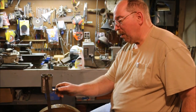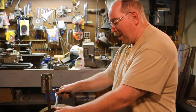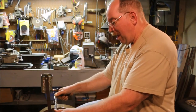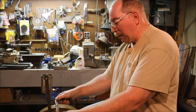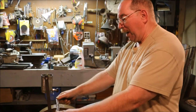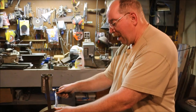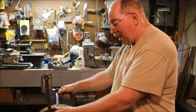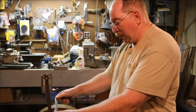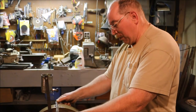I can see one issue. The vibration is causing the valve to open. I think a little tiny O-ring in there would probably put some friction on that valve and make it so I don't go through the water as fast. Because right now I've got a flood pouring out. But at least the valve lets me control it. If I drilled a hole in there, I would have two choices. Make a new hole and plug the old one, or hit the first one exactly right.